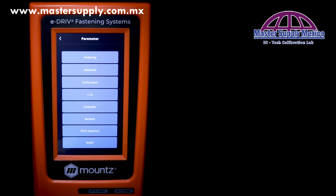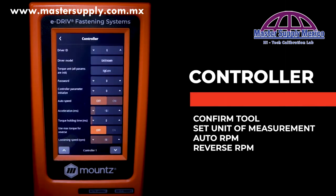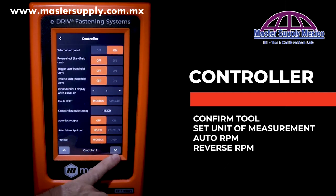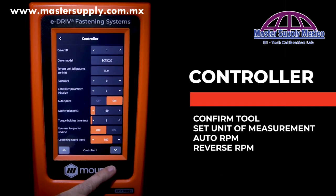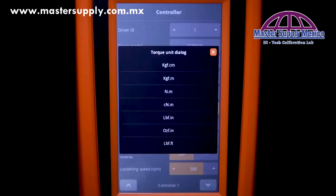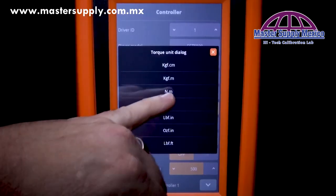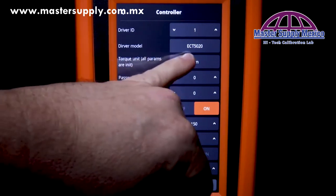Now finally, we want to look at the parameter menu and we want to go to the controller tab. Now there are a lot of settings in the controller tab, but we want to look at just a few here to get us up and running. So first, let's go ahead and set our unit of measurement. There are 7 different units that we can select. In this case, I will stay with Newton meters.